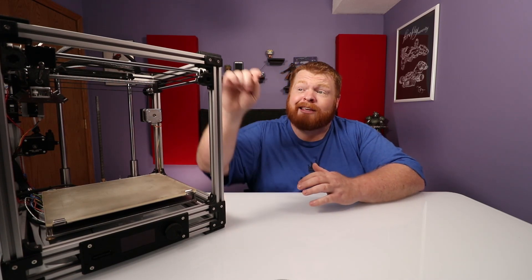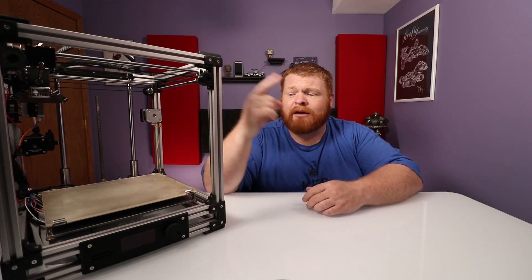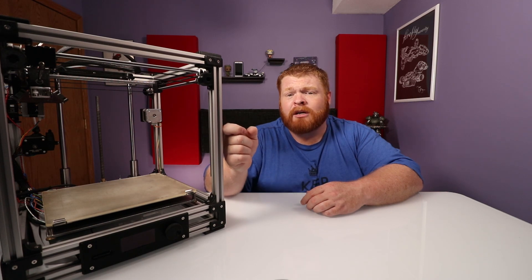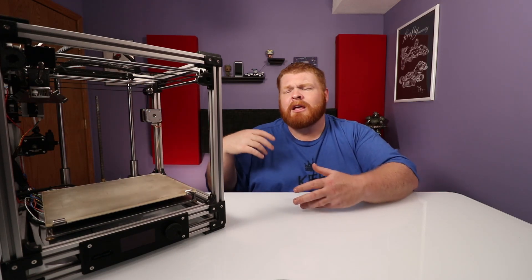And all the pieces needed to be printed in order to make this 3D printer. That's right — a lot of these brackets here, almost all of them, are going to be 3D printed. I was able to build this myself through the help of a friend who had a 3D printer. He let me borrow it, I helped dial it in, and then I printed off all the brackets and mounting points to assemble the 2020 aluminum extrusion into a 3D printer. Obviously there's stuff you can't 3D print, such as the build plate and the hot end, so that's all stuff I did have to purchase.